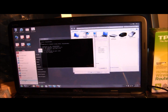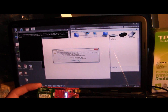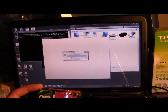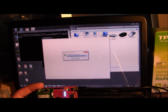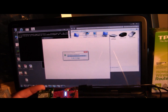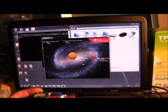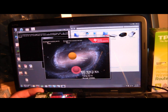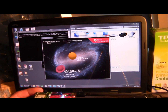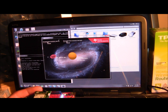Having downloaded the Texas Instruments demo GUI program, we start it and it says: would you like to configure the CC3000? We say skip, because it cannot detect the TP-Link router or configure the CC3000 automatically — the demo doesn't quite work automatically. But telling it exactly which interface the TP-Link router is on, we say OK, and it pops up a little globe showing one node connected — that's my laptop. And you'll notice this is the same IP address, 192.168.2.101, that the CC3000 reported over the serial port.